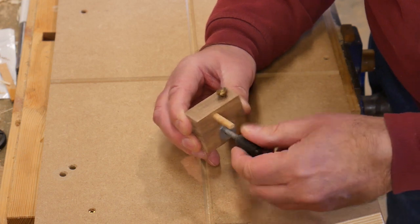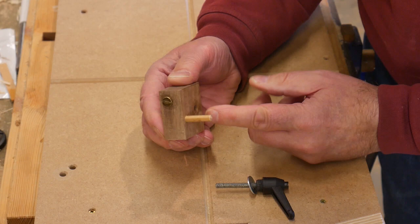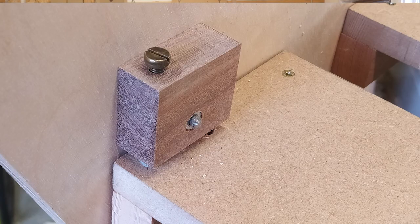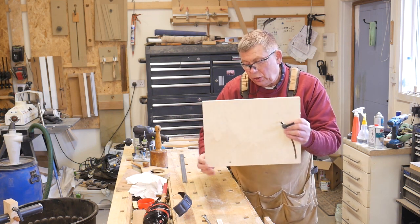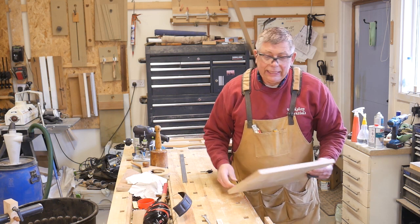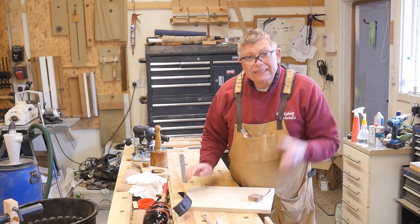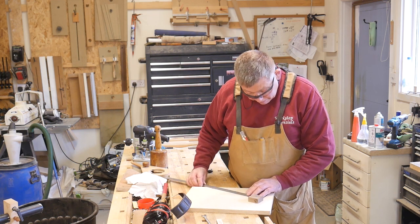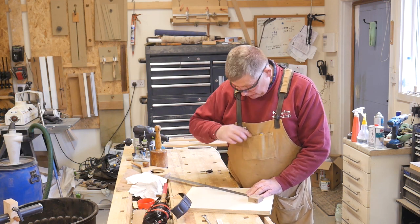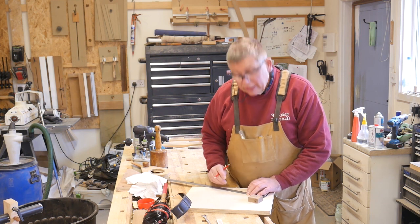I've finished my fine adjuster. It's got an embedded nut on the back for the clamping lever, and it's got an M6 bolt in here which will give me the fine adjustment. There's also an alignment pin so that when that goes in there, the block will always stay parallel to the bed of the actual machine. When that is hard up as far as it will go, that means the drill will be as low as it can go. So I need the centre of the drill to be at least down to the bed of the machine. I'm going to mark exactly halfway between my fine adjuster screw and the pivot point — that's 280 millimetres there, so 140 millimetres — and that is going to be the hole for my drill.